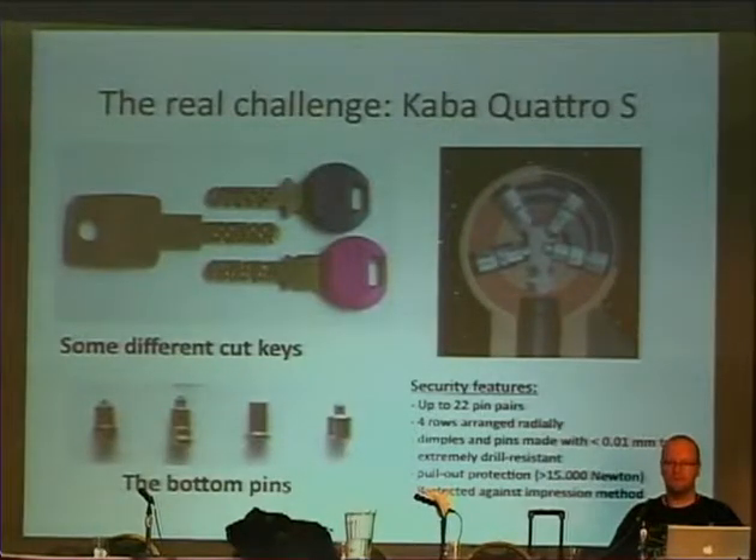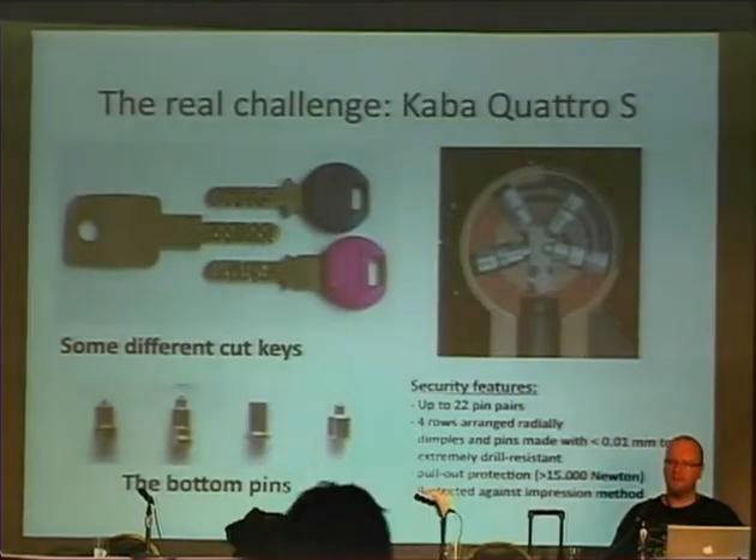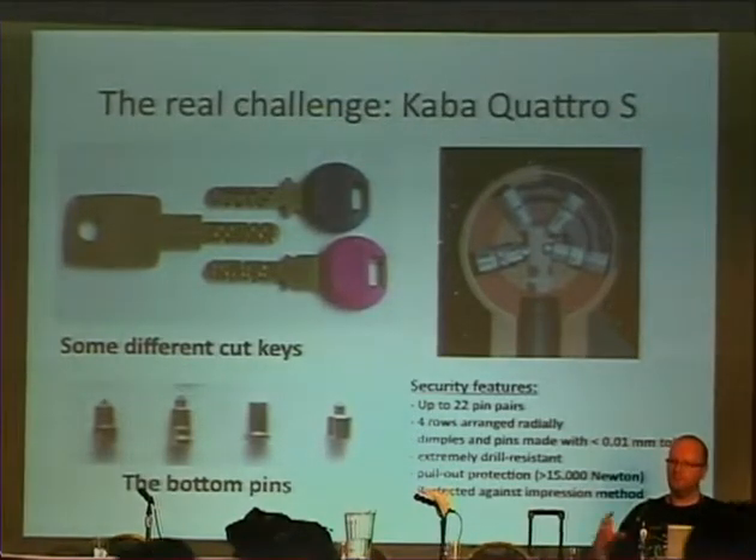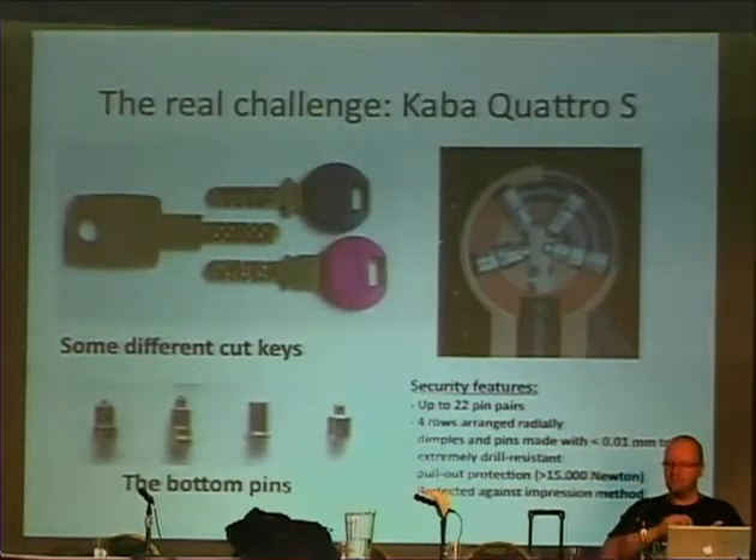Han and I visited Vienna a couple of weeks ago and there's a company called Kaba. If you talk about locks made like a watch - these locks are so exact, so precise, really one of the most high-tolerance locks I know. They have more than one pin; sometimes up to 22 positions where pins come from four angles, and the pins are really small and really pointy. If you try to pick it and you put tension on it and start raking, the lock will all of a sudden start to run less smooth. It's very easy to disturb the lock, but it's very difficult to pick or manipulate it.